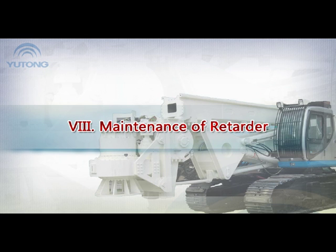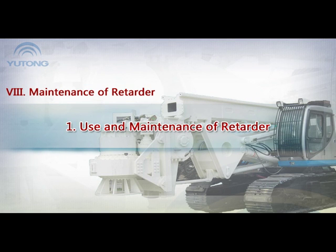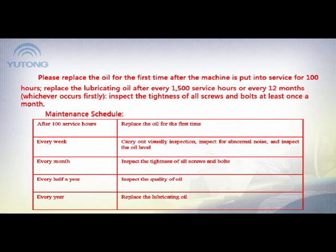8. Maintenance of retarder. 1. Use and maintenance of retarder. Please replace the oil for the first time after the machine is put into service for 100 hours. Replace the lubricating oil after every 1,500 service hours or every 12 months, whichever occurs first. Inspect the tightness of all screws and bolts at least once a month. Maintenance schedule.